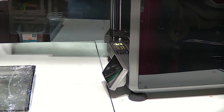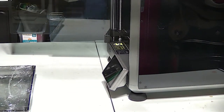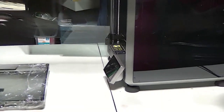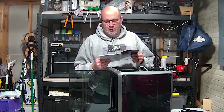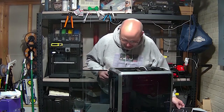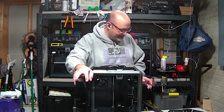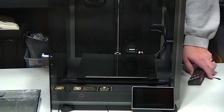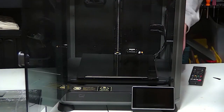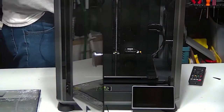The bed should be locked down out of the box. We need to remove three screws A, B, and C according to the location of the yellow arrow. Inside here — we'll turn it this way in a second. I'm going to try hard not to break the glass. We are going to remove three screws. You can kind of see the yellow arrow in the back there. Where is my 2mm Allen wrench?